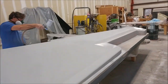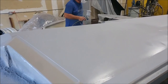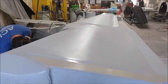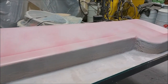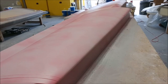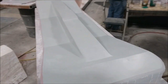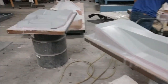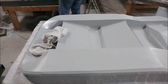Here's the right upper wing skin plug — Jeff is putting the second round of primer on there. That's the second-to-last of the big wing skin plugs to get its second coat; the left-hand side still needs one. Devon has also put down the guide coat on the left wing skin, so that one is ready for its final sanding, then waxing, then the rubber profile, and then pulling a mold. The landing gear brace plugs are already getting waxed — they had all their wax coats done yesterday and just need the rubber profile, so they'll be ready to pull molds from next week.